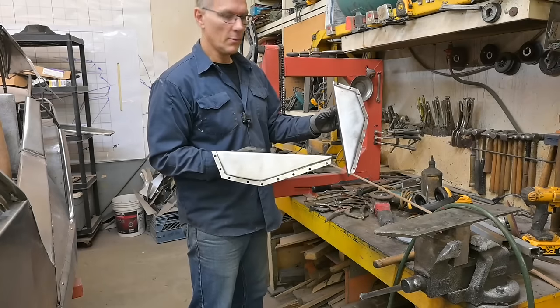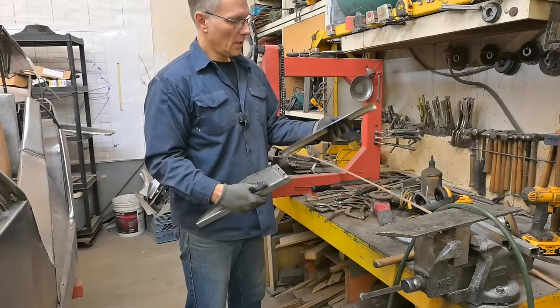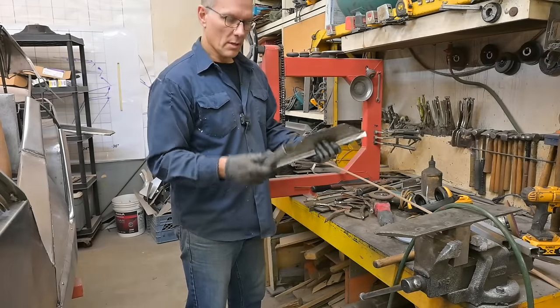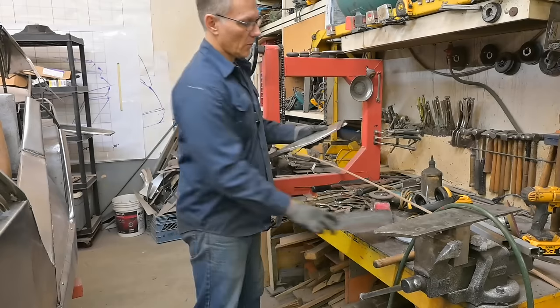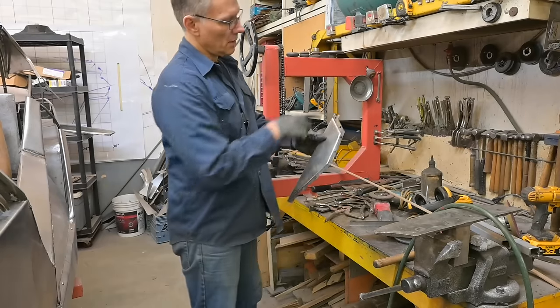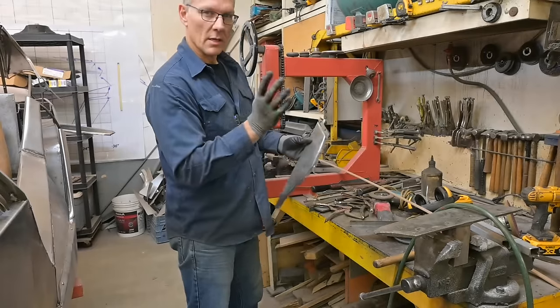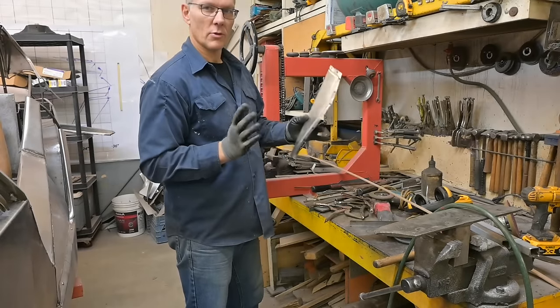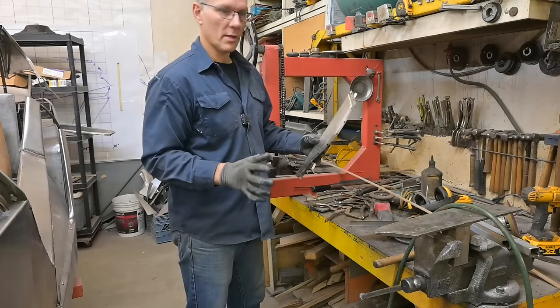Okay, as you can see, we've got two very nice flanges. Take some lacquer thinner, wipe off the marks, and get them installed. Now, I won't be able to get you guys in along with me. What we're gonna do though, I'll explain it, put a couple tacks, three, maybe four tacks with the MIG, sneak in there, tack it, and try it. If everything works out really well, pull the structure out and final weld everything.